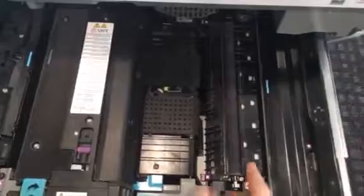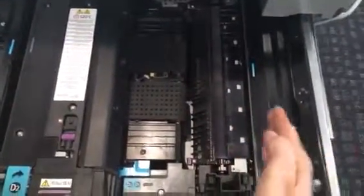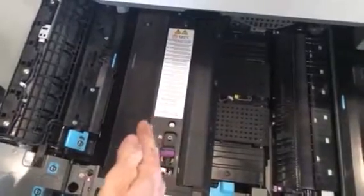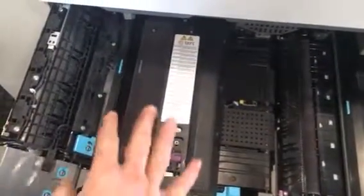This is a 500-pound, I don't know if you can see this, but that's plastic here, construction. A very short path, so that sort of means that this is your registration roll, or your image transfer roll, that means that the toner and the image is still taking place here, and literally about 8 inches over here it's going through the fuser. Sometimes there's any speed fluctuations and some of those things in the fuser. It can impact how the toner lays down on the image. That's where the longer feed length is really important when you're running with longer sheet sizes.